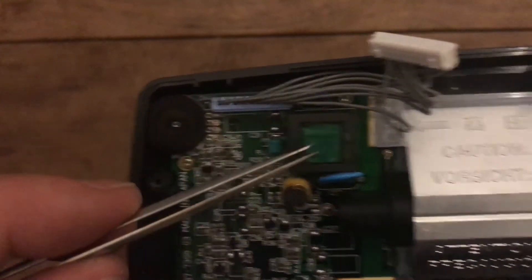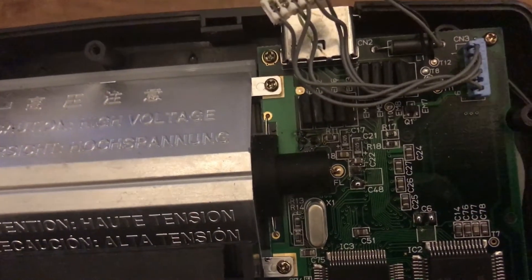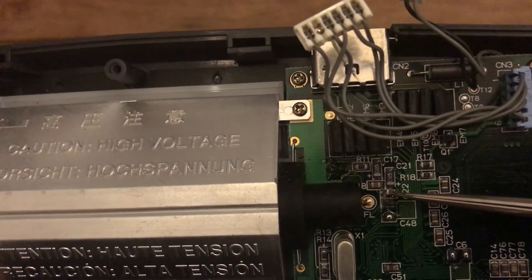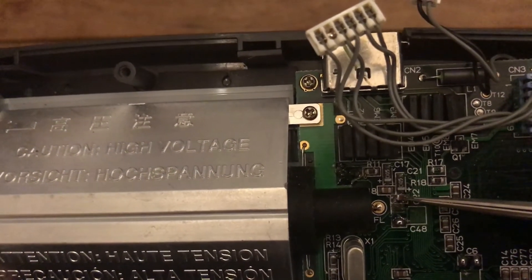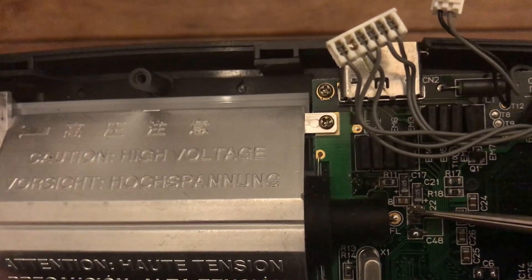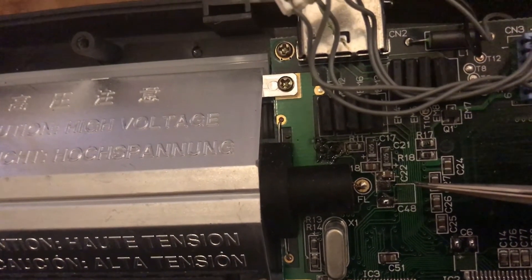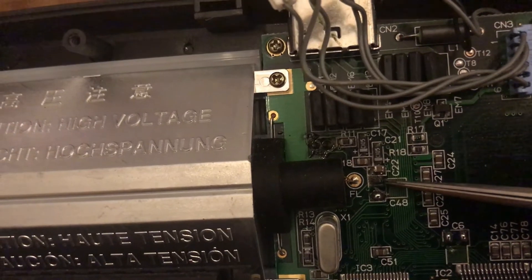There's a big one here. On the other side, I had a hard time — I was showing you this capacitor before, I think it's C22. That was so corroded, it had fallen off when heating up the leg. The heat dissipated and it just flew off, and it took along the pad underneath it. So I had to improvise a bit and stitch as much as possible there. It's slightly overlapping, but I checked with the multimeter and there is no short anywhere. I missed this pad — I'm going to have to clean it up.